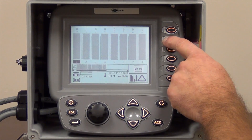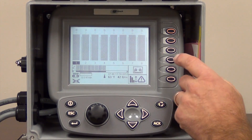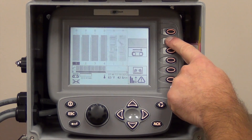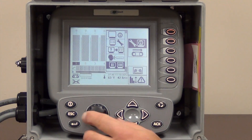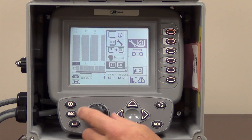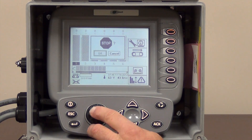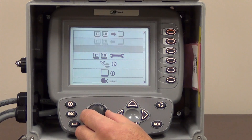The next thing we need to do is build a configuration for the paver that this AutoVibe system is going on. So we need to come down here, push the second button down twice, and come down to Roman numeral 2 and 3 by turning our black knob and highlighting that. Open that up, press the OK box, and then it is going to ask us to build a configuration.